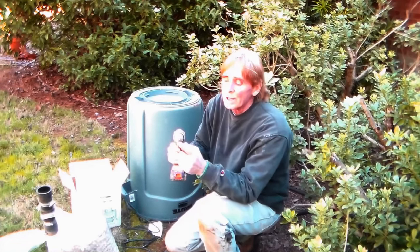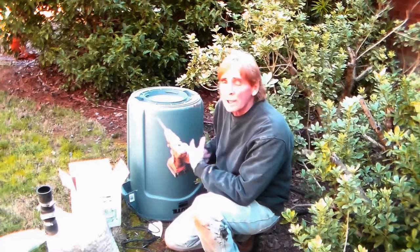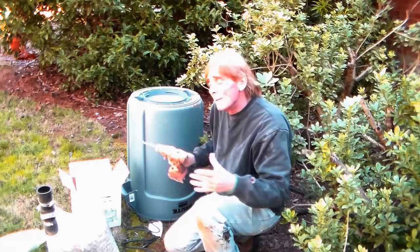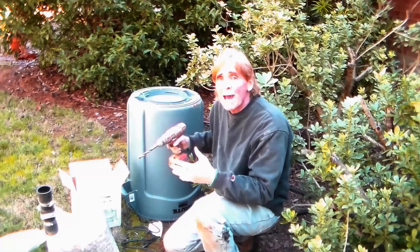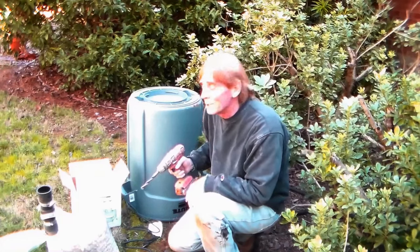What we have to do is go ahead and perforate it, so we're going to use a big drill and put holes all the way around it, and a couple in the bottom so it doesn't float up. We're going to surround this pit with gravel — that allows the water to just percolate right into your sump pit, and the sump pump lifts it up and takes it away.